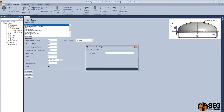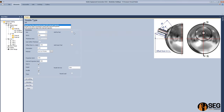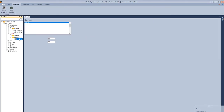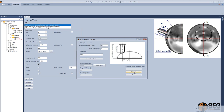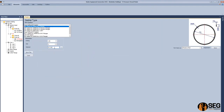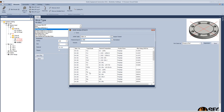Let's add another nozzle but this one with internal projection. Let's add nozzle N4 — select the size, schedule, and the offset from the vessel center line, define the orientation, and define the material of the pipe, select the grade. Define the nozzle service as a drain, select the external connection, and add a flange to the external connection — select the type, size, schedule, and material of the flange, click done. Now define the projection of the nozzle from the seam line of the head — the pipe projection is calculated automatically. Now let's add a gasket and then a blind flange to this nozzle. Select the type ASME B16.5, define the size, schedule, and material.